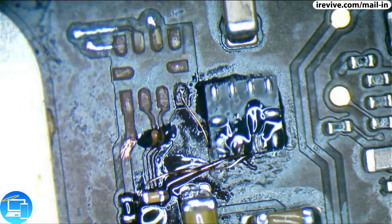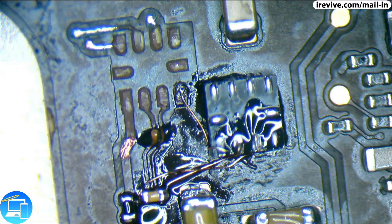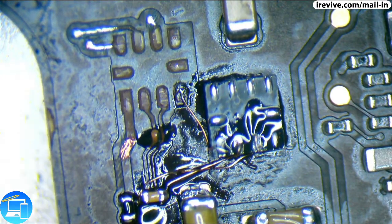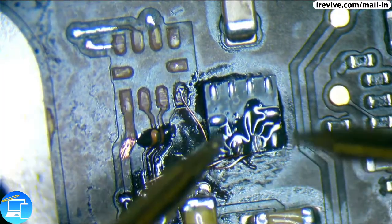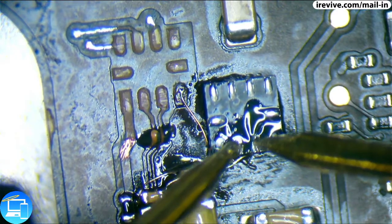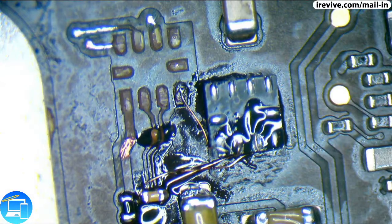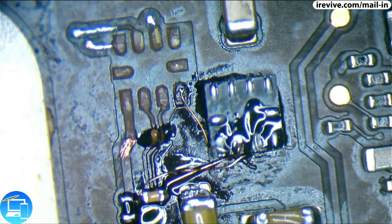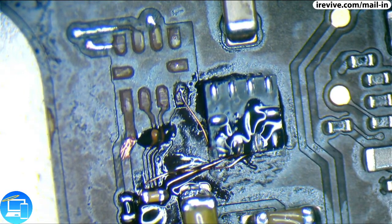Alright, so before I go any further, I want to make sure that pin 2 and pin 3 do not have continuity between each other, because it is a capacitor. So let's put our multimeter in continuity mode and touch both 2 and 3. Beautiful. There's no beep. Despite the fact that the wires are laying on top of each other, the enamel coating is doing its job and is preventing the wires from actually being conductive.